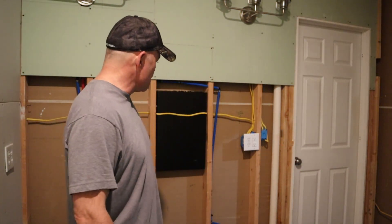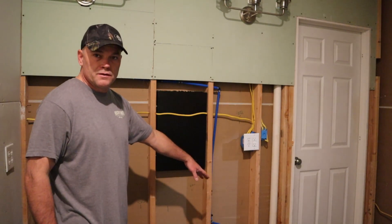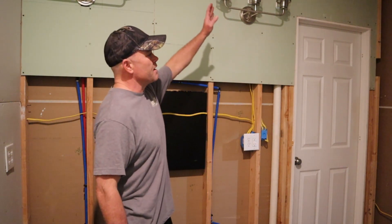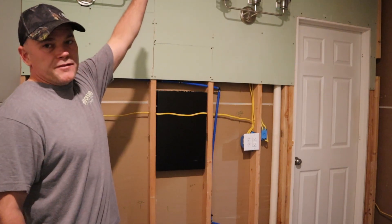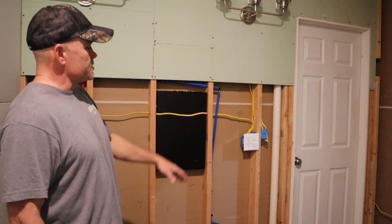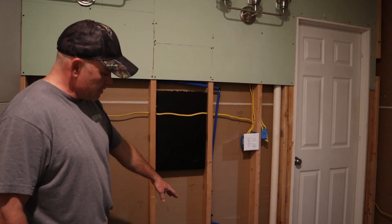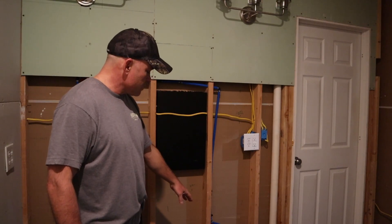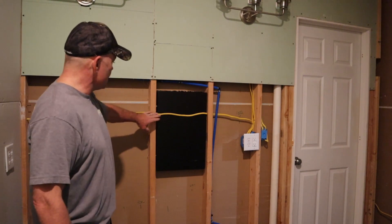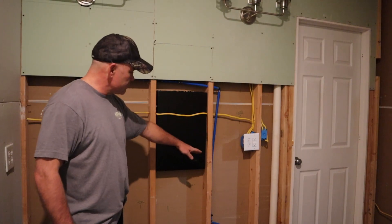What we're going to be doing today is first I'm going to get my plumbing, my drain pipes glued in and installed, and then also have to get this pipe right here. This is my exhaust pipe - it actually goes all the way out the ceiling of the barn or the shop house. That's just for all your gases and fumes and stuff like that to escape. But I am going to glue in and put in all my piping, all my drain pipes, and then I want to move this electrical wire. I'm going to replace it - it's just not going to work back here behind this safe. I'll probably run it underneath and back to that box.